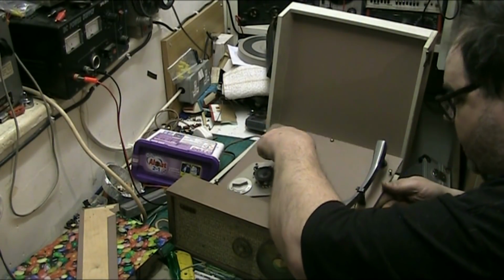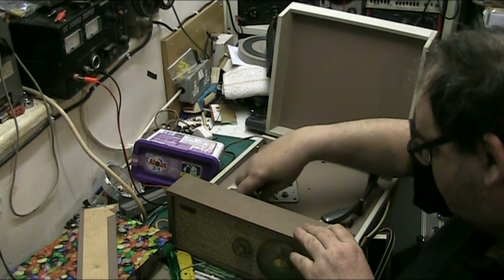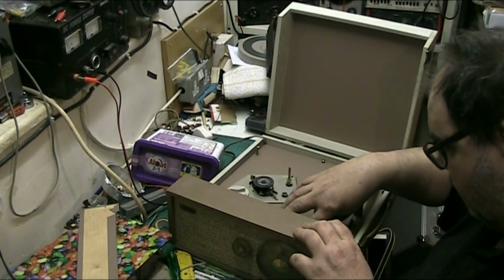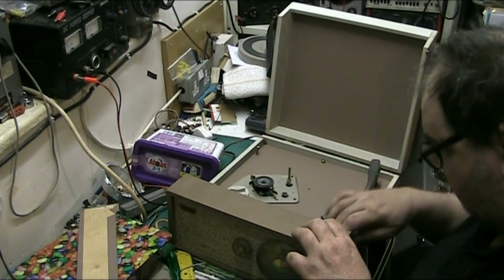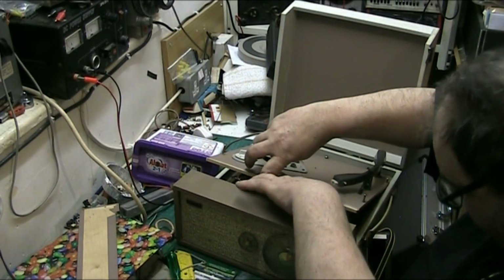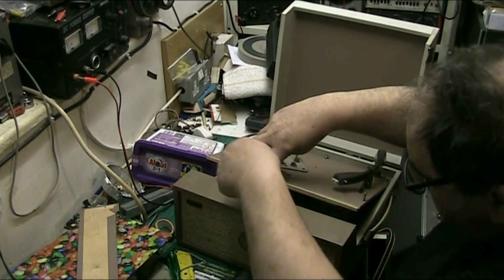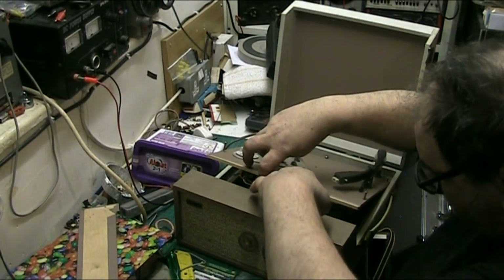Yeah, well, that just shows you, doesn't it? Anyway, there we are. That's it. That's that. All these wires need to be tidied up, they can all be done later. Just make sure we've got nothing draping over the valves, because the valves get hot. Just make sure no wires are draping over the output and stuff. We've got one. There we go.